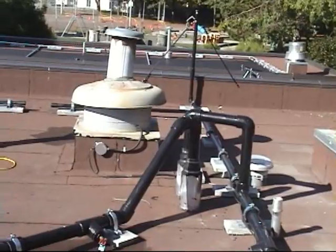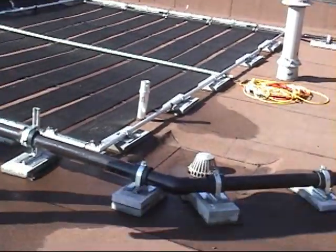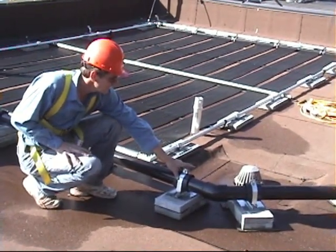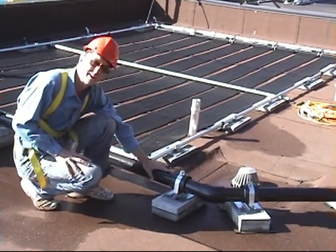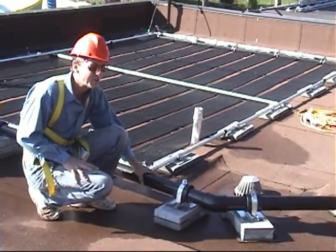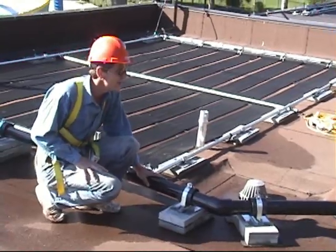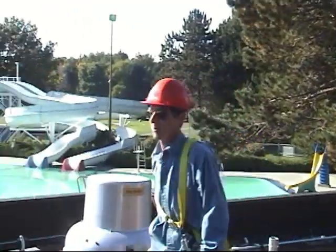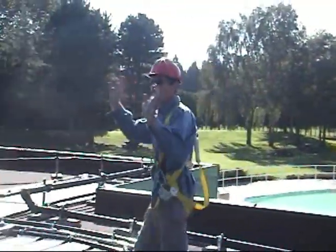Notice the extensive use of slip rollers on our piping. This is a four inch piece of ABS or PVC clamped to the footing, so the three inch pipe can expand and contract with temperature without ripping the footings apart. There's a lot of movement with temperature on a solar heating system because there's a 100 degree temperature swing. Plastics over any length will move — 32 feet will move about two inches back and forth.